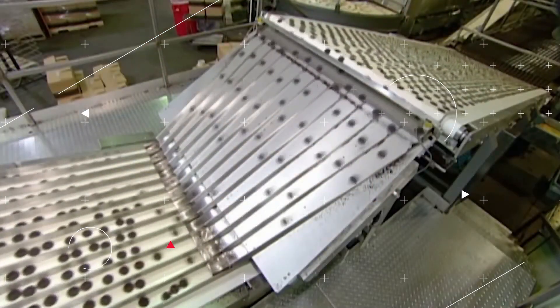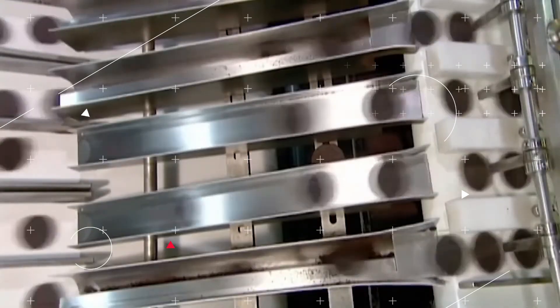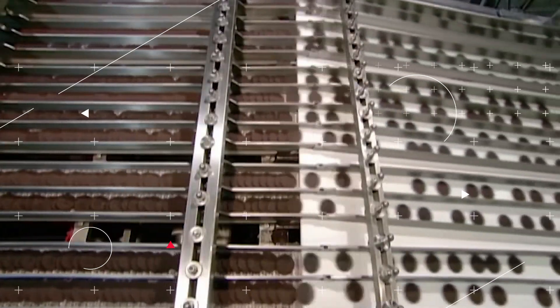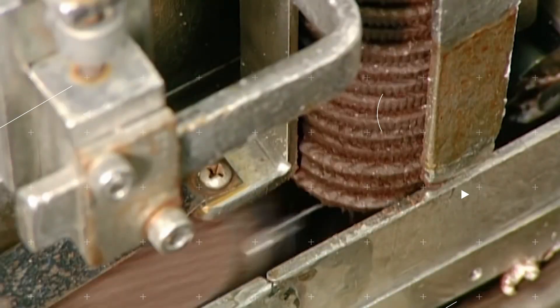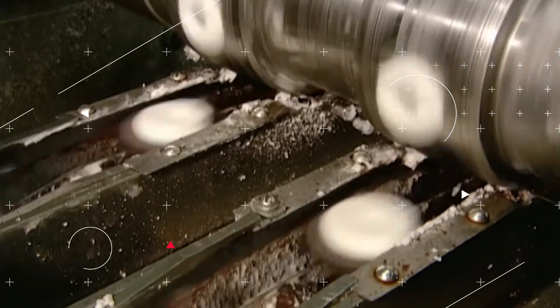Once the filling is prepared, it's loaded onto a pump through which it's dispensed onto the cookies evenly and precisely. Meanwhile, the now-cooled cookies are loaded onto another conveyor belt, which feeds them into chutes. The cookies are passed through ramps designed to ensure they fall a certain way — one group falls face down, showing the design pattern, while the other falls face up, revealing the plain side. This second side forms the bottom of the finished cookie, where the filling will be placed. A pump deposits the filling onto the bottom part of the cookie, and then they move to another machine that gently presses the top cookie onto the bottom cream-filled one to ensure they stick together.